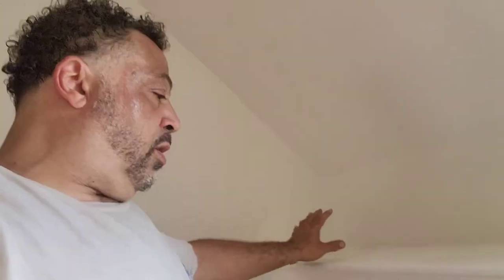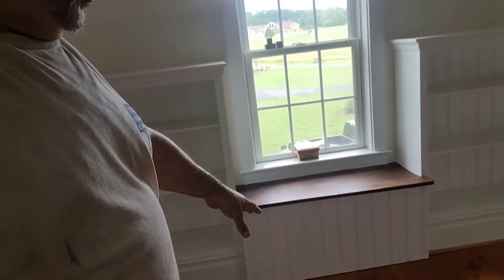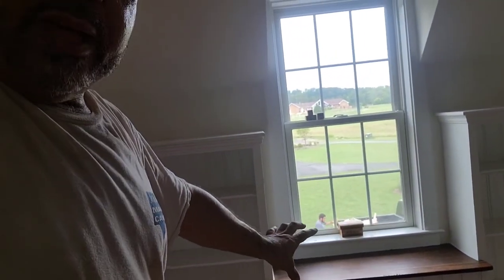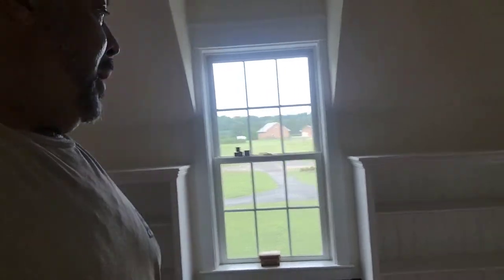You can get a look now — we took a space that was kind of unusable because of the way the roof line comes down here. But because we built the bookcases down here low, we can put pictures and things on here; we've got the extra bookcase space which is great. We took the molding and carried it on through here, although I did not run it across the front — I'm going to check with the homeowner and see if she wants that across the front as well. I'm thinking maybe we'll just put the cord around because you like seeing that beadboard. If we put that 10-inch wide base up there, you'll lose most of it. But it ties it all together. We ended up using our vibrating cutter to cut the miters for our molding, to be real, real careful. I think it's got a great charm.